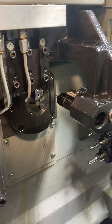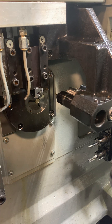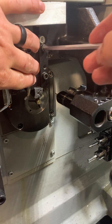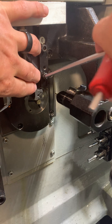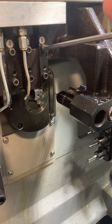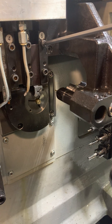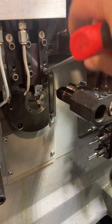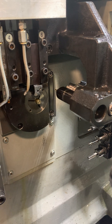Set this in a little holder right now. All we're going to do now is jog out the stock. Slide the tool onto the stock. Snug it up just a little bit so it's tight, and then jog it off the stock to fully tighten it down. That way you don't risk the insert moving while you're tightening it down and slightly chipping the tip. That's it.